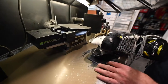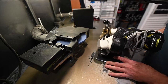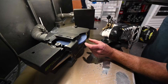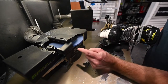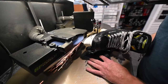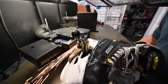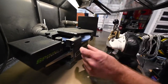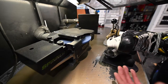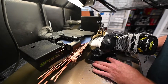Now that we have them level, let's talk about consistency. You want to be moving when you start sharpening - a lot of people will go in and then sharpen, but you want to be moving. And you want to stay to this part of the wheel; you don't want to get yourself out into the edge. A little bit of an angle coming in. If you look at the color of my sparks, they're going to be the same all the way across - I'm going to try to make them the same all the way across - because that means we're going to be burning the same mass of steel. We'll make initial contact to the end.